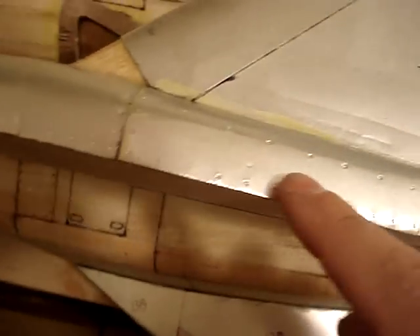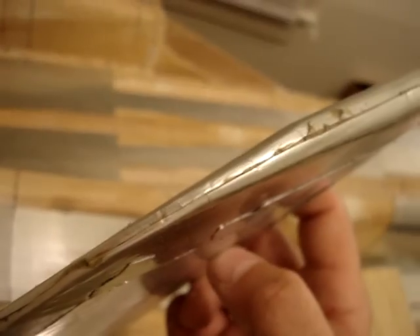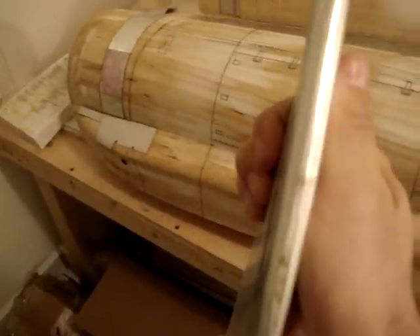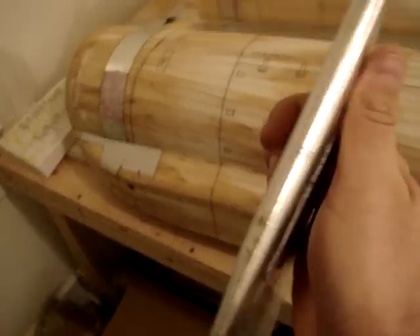Down here we've got a couple more things — we've got our vertical stabilizers. I've had these done for a couple of days. You can see a lot of the fine detail on these fairings that are actually removable on the full-scale aircraft. We're just trying to get all this stuff detailed in. Then up here we've got more doublers. The tips are a little different to do — I had to anneal those as well. Since I can't do it all with one piece, I did it in two halves. You may be able to see the seam in there. A little bit more finishing work to do on the final product, but that seam should be where the actual mold parting line is anyway, so it should be pretty well covered up once you get some parts going.